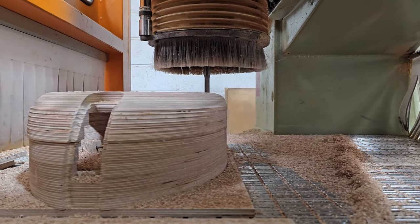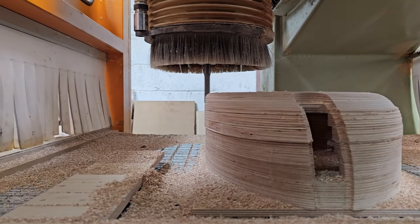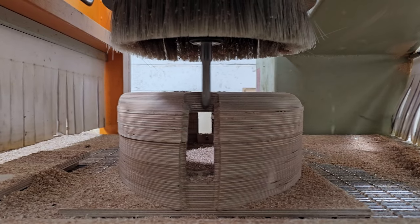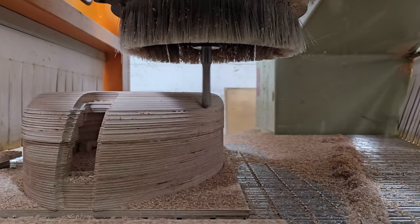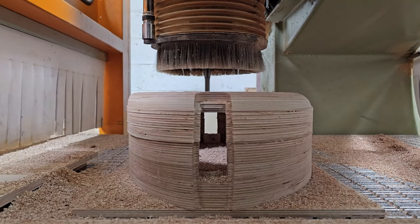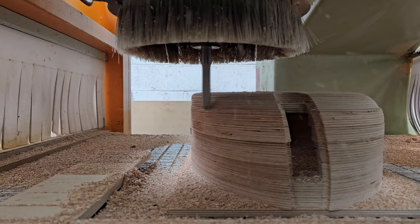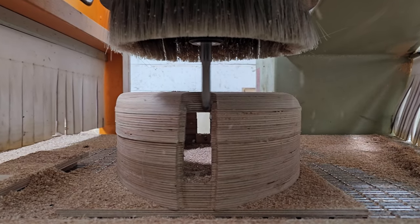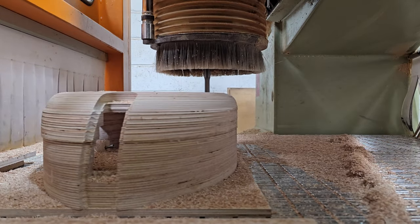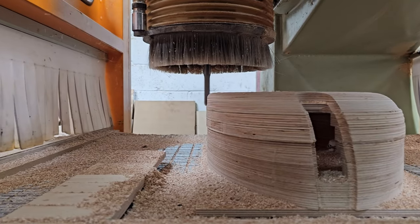What that means is it's drawing vacuum at this side and there's a vacuum pressure gauge, and you can set a minimum vacuum. So it'll pull the M38, and if there isn't enough vacuum there, if the parts aren't fixed down properly, it won't allow you to start the program. This is really nice. So if you don't have a workpiece on there, if you hadn't finished setting up, for instance, if something's not right, it doesn't launch straight into it.